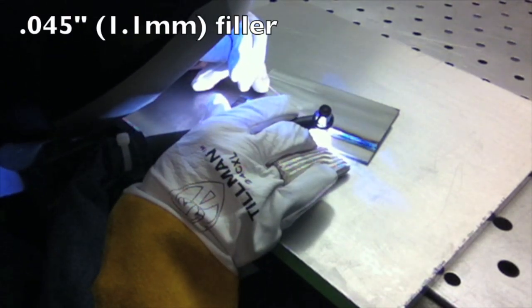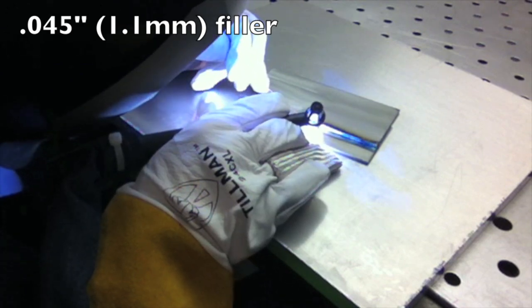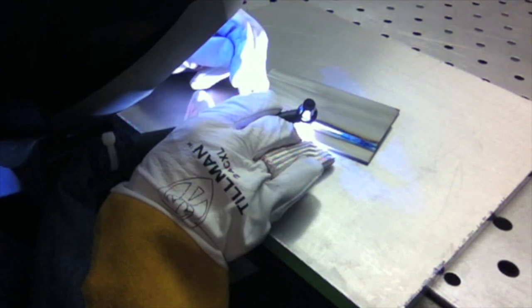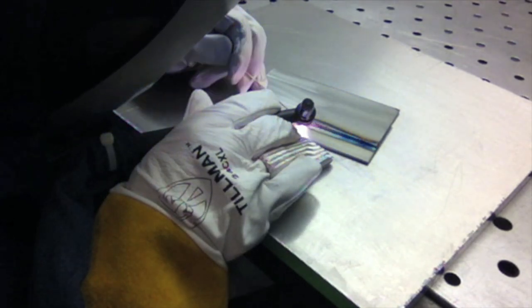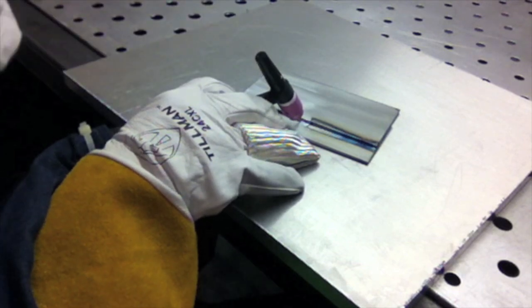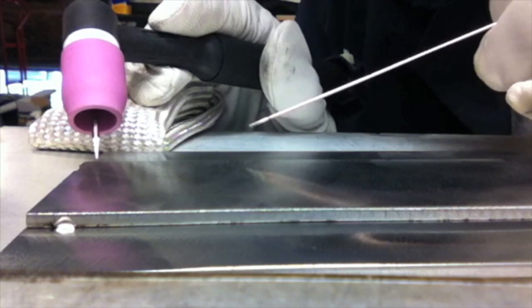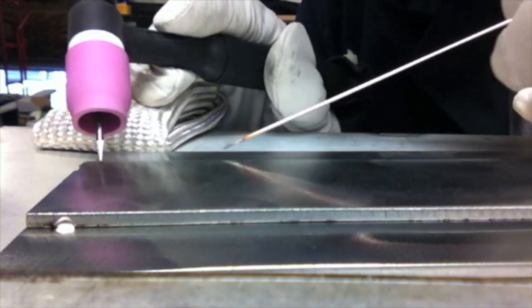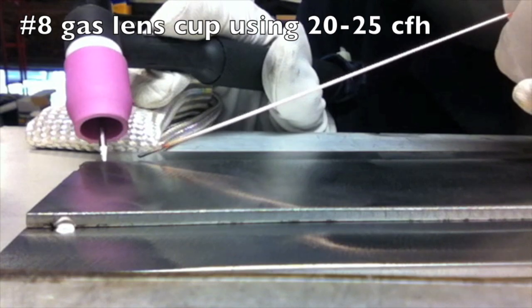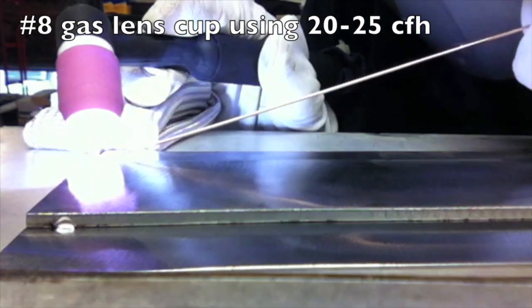It's not really a defect or a problem — it's just an observation. If you want a nice tight bead down in there, and if your project or job requirements don't require you to weld all the way up to the edge and you want a small bead with little distortion, then this is the way to do it. That's why we're using small wire right now, just to keep the bead small and keep it from going completely up to the edge. Some jobs are better off done with the bead completely filling the corner — the leg size of the weld completely going up to the corner of the metal, and we'll do a little bit of that in just a minute. Here's another look at it, taking a few dry runs before we get started.